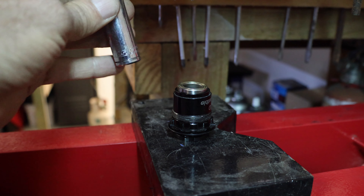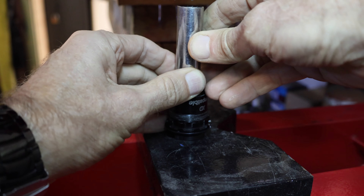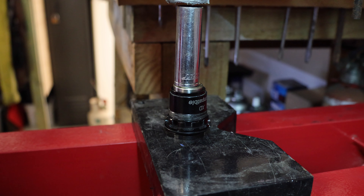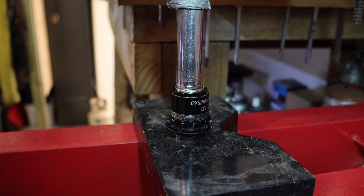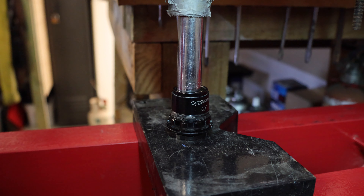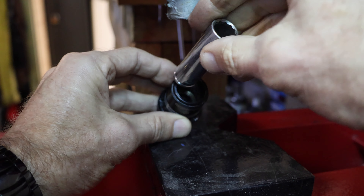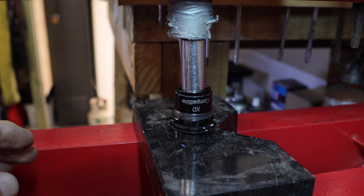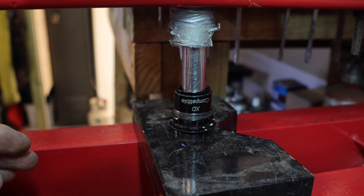I'm going to use a 14mm socket with the press to get this in so I've got good control. I just want to get the bearings in nice and smooth and evenly. Don't forget this is the first bearing going to the back. It's going to drop down in a minute because it'll find that hollow in the middle of the driver - there. So it found the hollow in the middle and the bearing's fallen through to the next section where it's got to press into. I'll just line that up again and push it through until it feels really tight. Now we've got the bearing in the bottom of the driver.